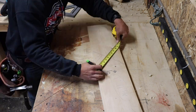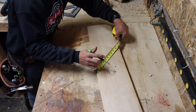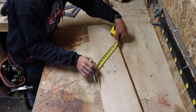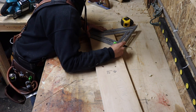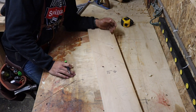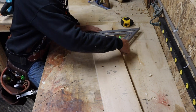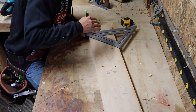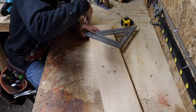So now we're going to work on the tail. I want a 6-inch overhang, so I'm not going to pull over 6 inches — I'm burning 6 on the tape and marking 12, but actually you want to mark an inch and a half less than 12 for your fascia. I'm going to make another plumb cut at that mark. On the job site what we do is mark 5 and a quarter just to play it safe and square over — that's just for your soffit. Because we do a lot of metal soffit in our area, so it keeps it out of the way of the soffit guys so they can just run their soffit and it's not hanging below the fascia at all.